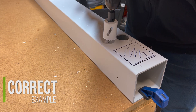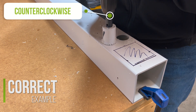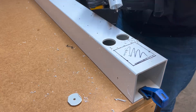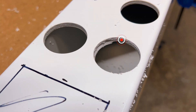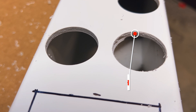The better way is to start initially drilling clockwise until the teeth of the hole saw make contact with the plastic, and then flip your drill into reverse and finish drilling out the hole in the counterclockwise direction. Here is a close-up where you can tell the difference between the first hole that I drilled incorrectly and the other two holes that I drilled out in the reverse direction.